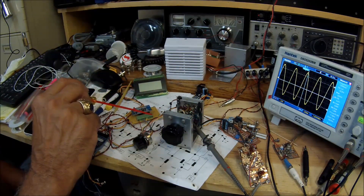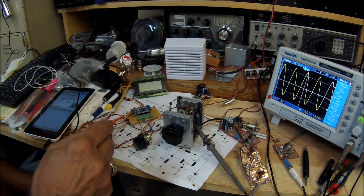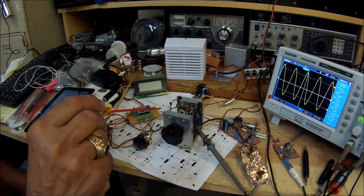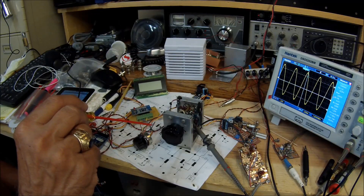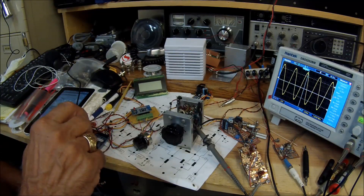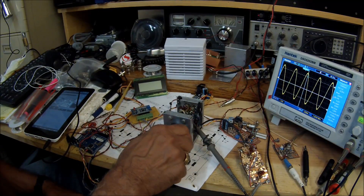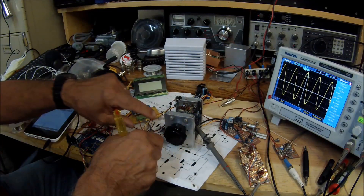And the VFO provides the local oscillator signal. I have also operated this from a DDS, and that will ultimately be the application — the DDS in the final configuration when we go to the single sideband transceiver. But to get you up and running, the intent is to use a VFO signal. You could use a VXO, but that has a somewhat limited range. The VFO will tune the whole 40-meter band, and as a matter of fact signals are quite strong here — I'm going to move this up to the phone portion of the band.